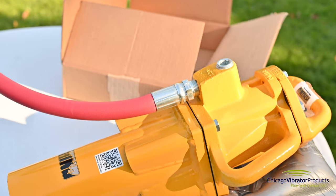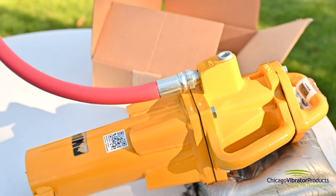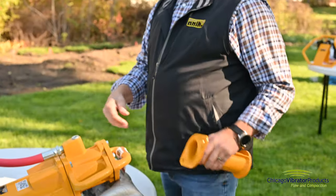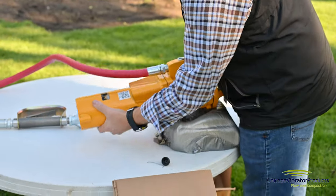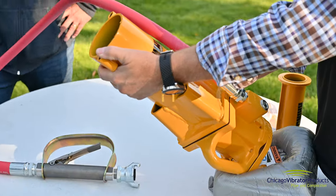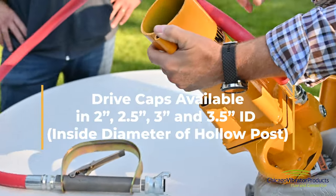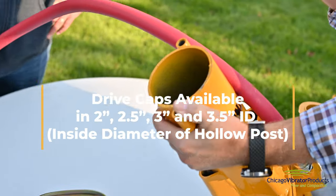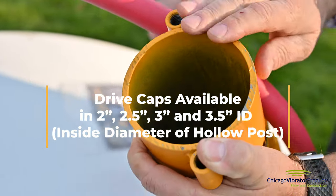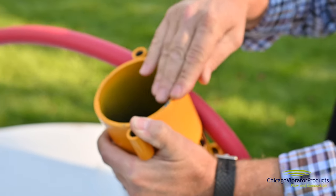We have adapters to go with it. Those throttle valves are made out of stainless steel castings so they don't rust. The piston diameter is 3 inches, so the hitting surface is only 3 inches. When you get a post that has a hole in the middle 3 inches or bigger, you have to use a drive cap — otherwise the piston will get stuck inside the post.